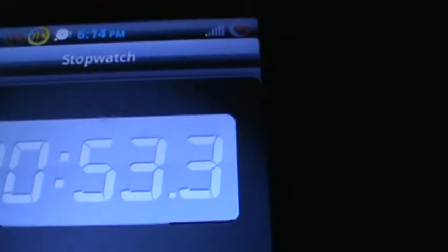Alright everybody, I'm back. You can still see a little bit of light coming out of that LED, but pretty much we're done. It already hit 100 minutes because, well, my clock says 0 because it started over from 99, but basically it's like 101 almost. Oh, sorry, my battery is dying. Come on. There we go. Yeah, see, 101 minutes. That's just straight off of the capacitor. And the capacitor now is at 6.4 volts. Now that's, like I said, pretty good. And that's it, I'm done with that.